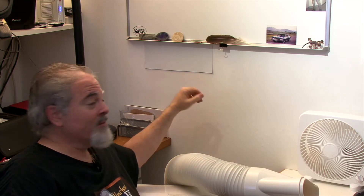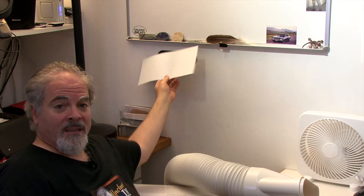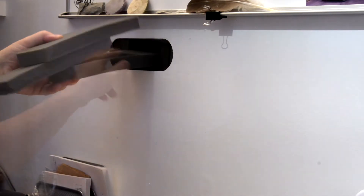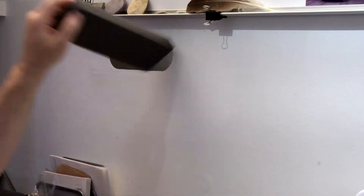Let me show you how this works. I didn't want a big hole in the wall when I'm not using the air conditioner, and in the wintertime I didn't want all the heat escaping. So I've got a magnetic cover that comes off, and inside is just some black foam rubber insulation — one inch foam cut down into smaller pieces so it's easy to take in and out.